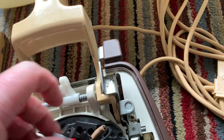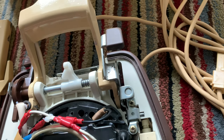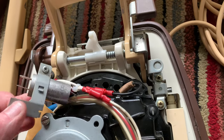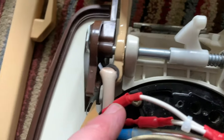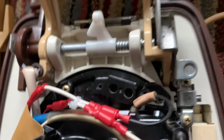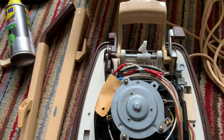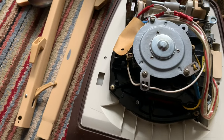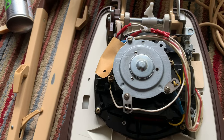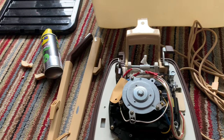I've took off the ticking time bomb, which goes like — it goes about there on it, actually goes like that. So the ticking time bomb goes here, and what you need to do is crimp and extend the wires there to bypass it. That wire was off the original machines. I do like to, if I strip a machine down, use the original wires, because when you take the suppressor out on the Seniors, the wires are too short on the Junior — you can either take them out or shorten them and they fit quite nicely. So we'll get this one built up.